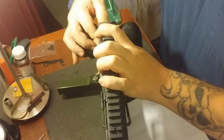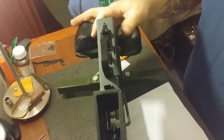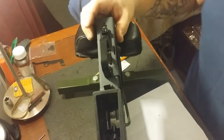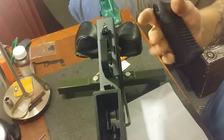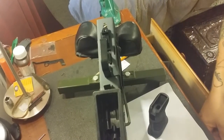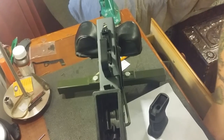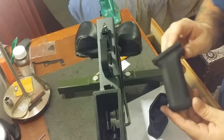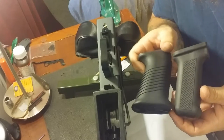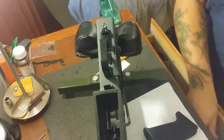You'll just reinstall the top cover and flip the gun over. The last thing is to install the grip — they included a really nice grip with this kit. It's kind of like a 249-style grip and it's got a big feel to it. If you've got smaller hands I'd almost recommend sticking with a standard AK grip, which Tapco makes for about $10. You can see the included grip is significantly wider and a little longer, which is nice for bigger hands.